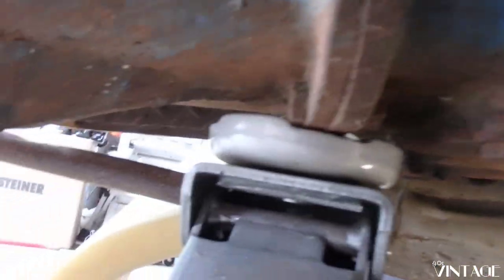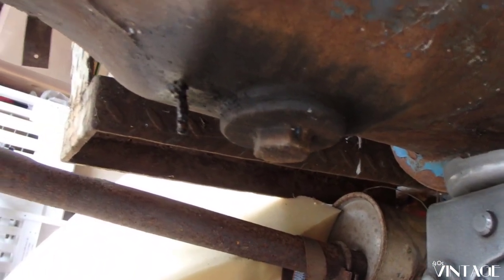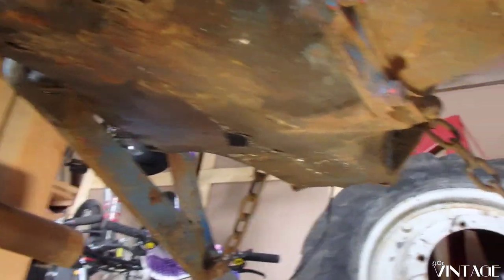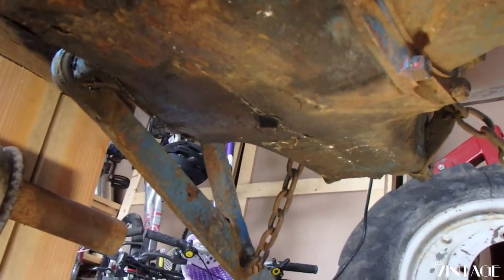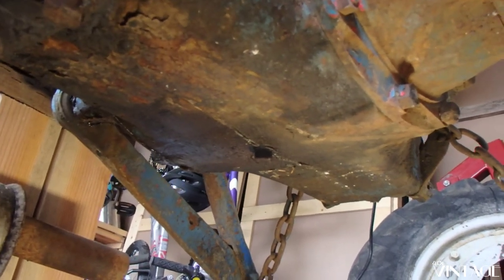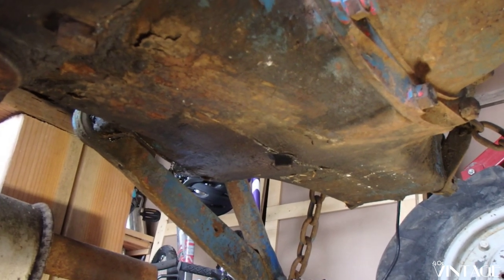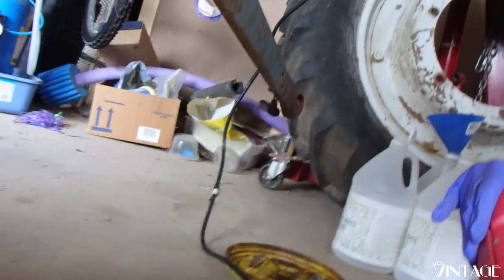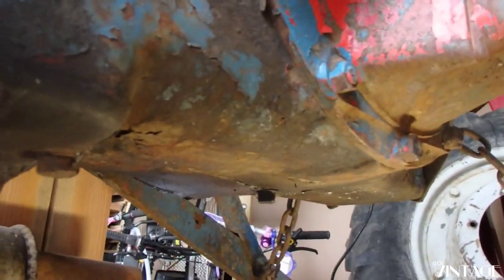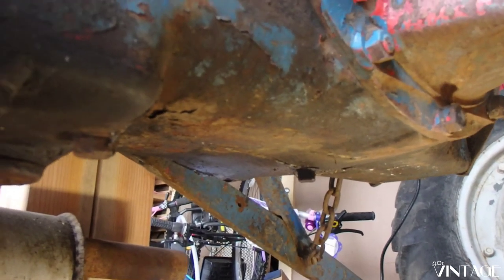And then finally, way up here in the front, in front of my jack, which you probably can't see very well, is another giant one that we're going to pull out. That's the transmission one itself. And most of the fluid will probably come out of that, but since we are tilted downhill because we got the back jacked up, there's going to be some coming out of each one of these. All told, there is, from what I understand, about 5 gallons, which is not going to fit in that. But that's why we've got a bunch of jugs over there. So we're going to be swapping. We got a funnel, and we're going to spill everywhere.